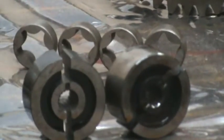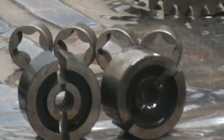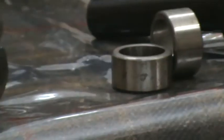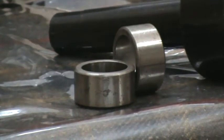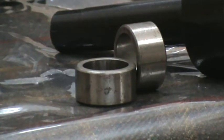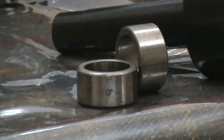There is an inner profile in the case of these pistons. With reference to the ID, the OD is to be ground with a very close tolerance. These are sleeves — ID and OD grind, very close tolerances. The geometrical tolerances within 10 microns — the ID and OD to be concentric — are achieved by Hydraulic Expansion Mandrels.